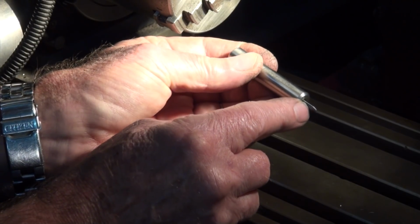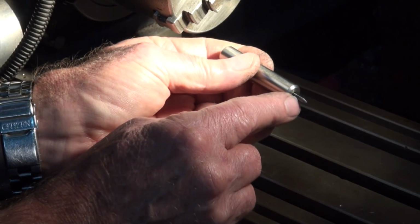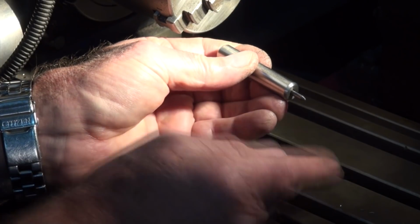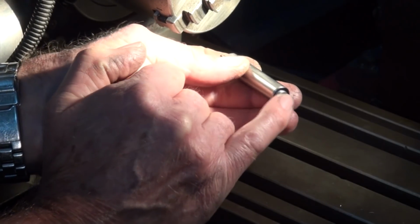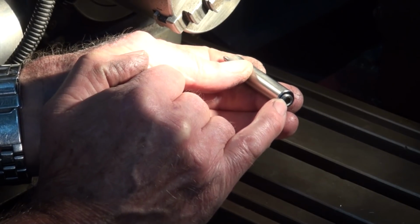It's not really a cutting process, it's more like a forming process, like knurling. And as well as forming an impression in the work, it also raises a very slight burr. Now, you can stone that burr off. I'm not going to in this case, and you'll see why later. At this end there's a socket head grub screw, and you can use this to vary the spring pressure on the stylus.